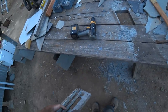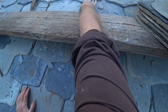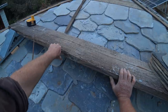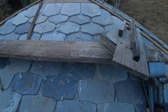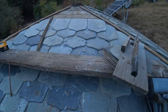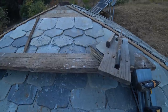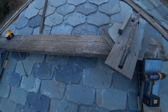Having the slate cutter up here is going to make everything a lot faster because I don't have to get up and down the roof constantly. There's a big gap right here that's unfortunate — I didn't take the time to be super careful about that. There's another one over here but I might be able to shim the back of it with a piece of wood. I nailed that piece of slate loose so I could fix this. As long as I'm close I can just put up a piece of tin right there. It's about 20% chance of rain tomorrow — I don't want to get up in the middle of the night, so I'll try to be dried in for tonight.